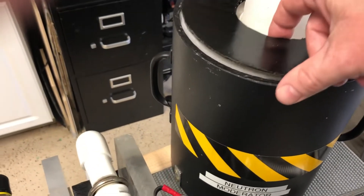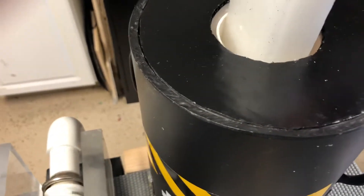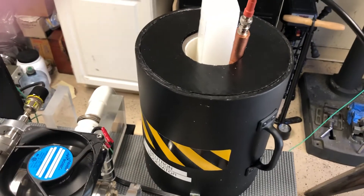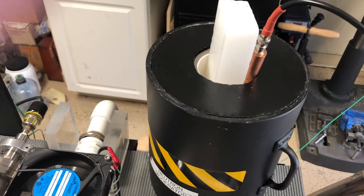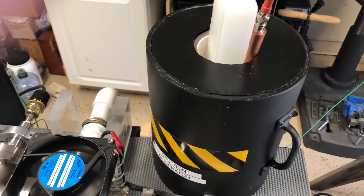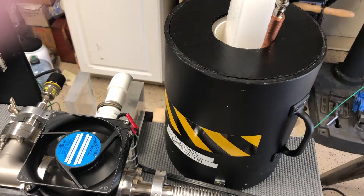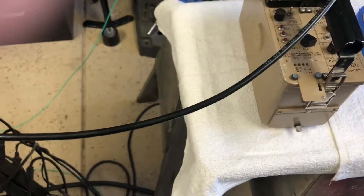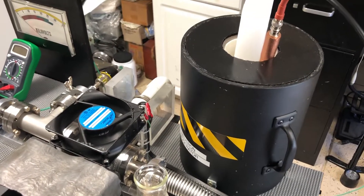For neutron detection, this is my wax moderator. It's basically about a 6-inch PVC cylinder filled up to the top with wax. I have a CHM-14 Corona tube. I was having a couple of issues with the Corona tube, but after going through the forums for almost 10 hours since my last post, I found a whole bunch of information on proper biasing and setting threshold levels. In order to get it to couple up properly and register with the Ludlum 2221, the bias voltage just on the threshold of Corona had to be exactly 670 volts.